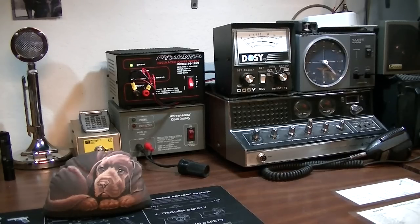I would personally stay away from the real inexpensive radios — they tend not to have as good filtering in them, and they tend not to have the capability to modulate or swing as well as larger chassis radios can. A mobile radio, if you do not know, is a radio that's designed to go in a vehicle — designed to run on 12 volts DC like you have in a car, not plugged into 110 volts inside your house.